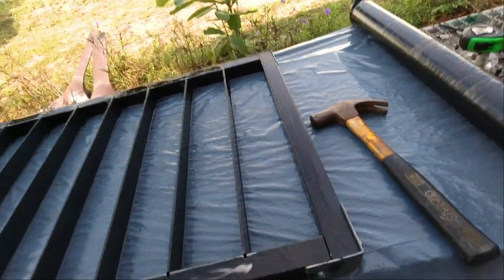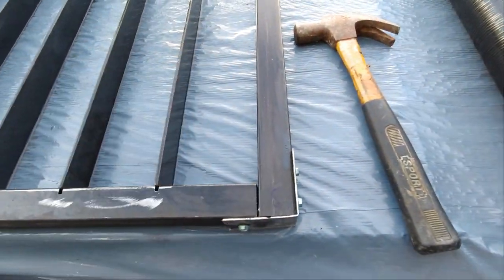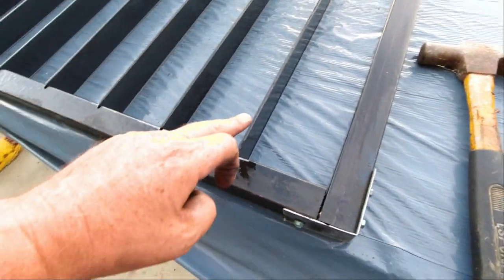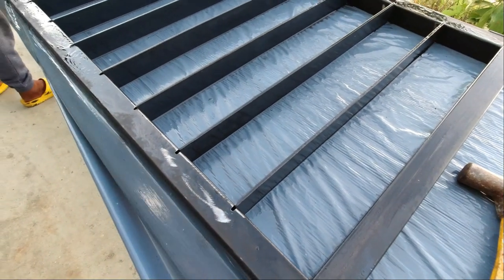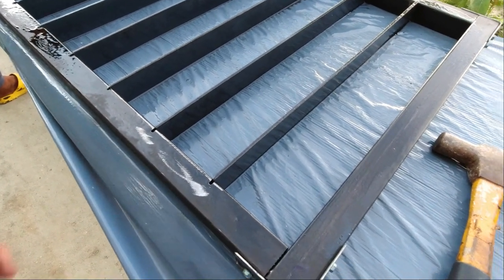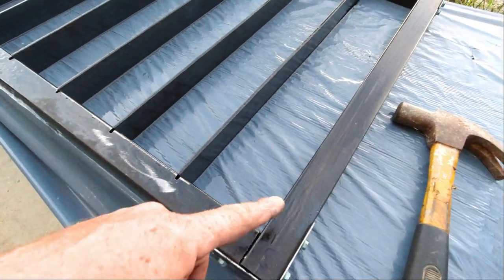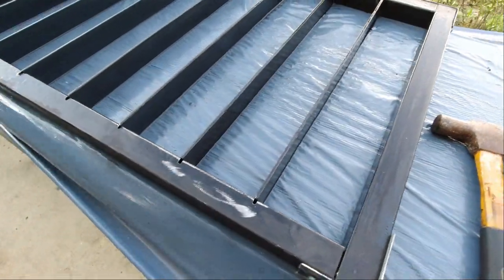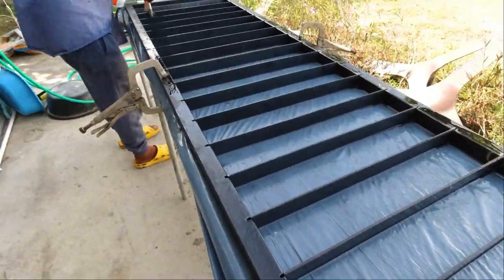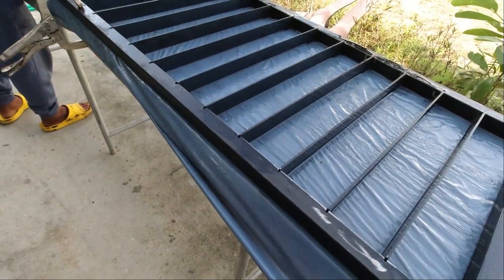What we've done, we get some box steel, at 1.5 inch thickness. We're getting some plate steel, 1.5 inch wide, and 10 centimeters, 4 inches, by 0.5 meter. Here we've got enough to do 20. We're making up 2 sets of these.